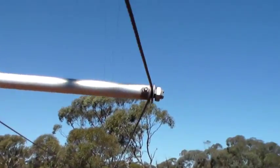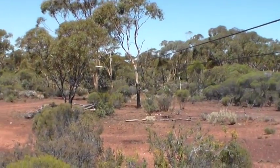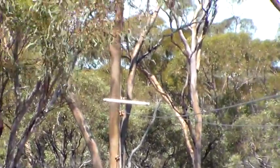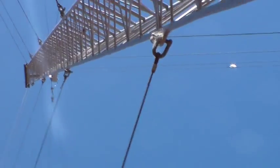There's a spreader — that's one of the spreaders — and that goes right down to another spreader about 20 metres away. Those wires go up and up to another spreader up there, and from there they go up to the top of the tower. At the top of the tower there's a terminating resistor. And of course we've got more guy wires down this side as well.